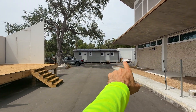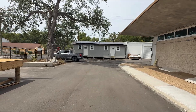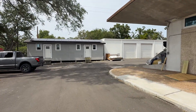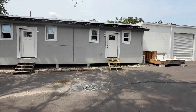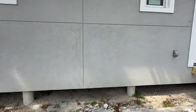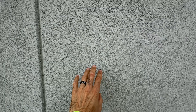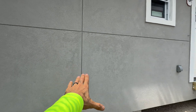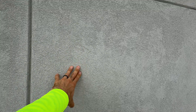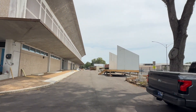That's the EFIS I was talking about for these front panels over here — that's the whole front of this building. One of our contractors is the largest specialty contractor in the state of Florida and they do EFIS. This whole front section is foam with stucco on it. If you're not familiar with EFIS, it's fiber-mesh reinforced — you can press in on it and it's actually movable, which provides an R-value. And foam is actually a great impact-resistant material — if two-by-fours are flying in a hurricane, it's very resilient and strong. That foam goes around all the windows and doors.